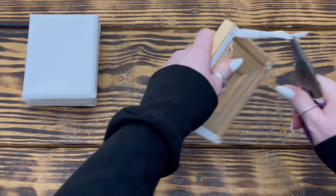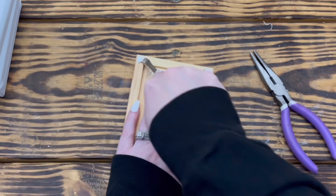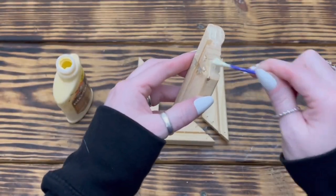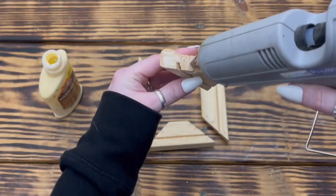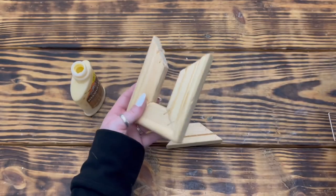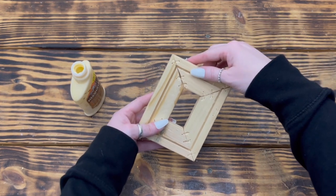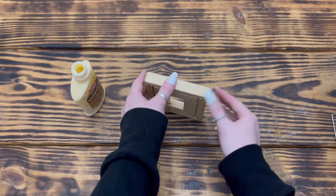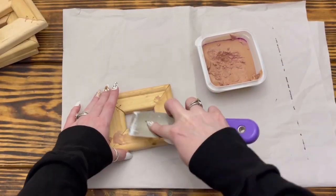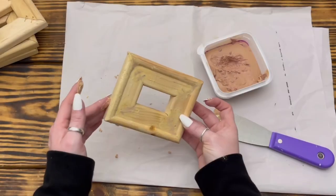Next I used a sharp utility knife and scored along the outside edges of the canvas on the back side of the frame so that I could easily remove the canvas fabric from the frame. Once I had the canvas removed, I used a pair of pliers to remove any leftover canvas on the back side of the frame. Then I took a flat-headed screwdriver and very carefully removed all the staples from the frame. Since these frames were only held together with staples, I had to use some wood glue and some hot glue to reassemble them, being careful not to mix the two glues together since they deactivate each other. Once I had all four frames reassembled, I took some wood filler and filled in all the holes and indentions left by the staples and set them aside to dry.